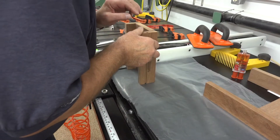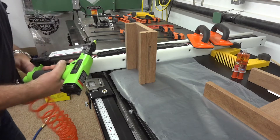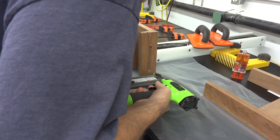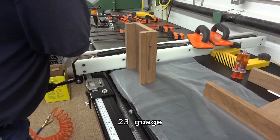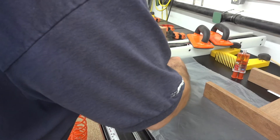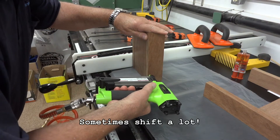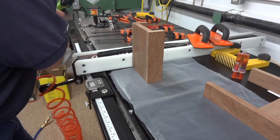I'm going to glue this little clock together in two, maybe three steps. I know right now there are people watching who are thinking, wow, he's using a nailer to hold it together. Well this isn't just an ordinary nailer — this is a headless pinner. I got this wonderful little tool from Canadian Woodworker. It fires a very small, narrow pin into whatever you want, up to two inches long, and the pin has no head. So after sanding your work down, you can't tell where it was. Those of you who use epoxy glue know how slippery it is — the two pieces have a tendency to shift. If I quickly put in these pins before the clamps go on, it'll keep the pieces from sliding around. I've done this before and it works really good.